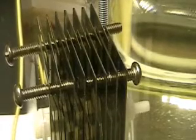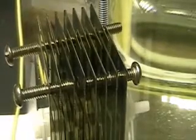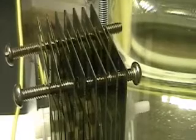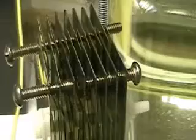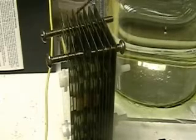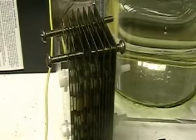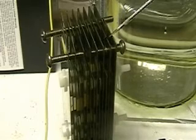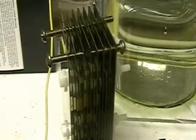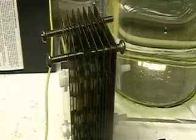This is hydrogen tap. What we're going to do here is a new type of test on the Aran cell — three inches by six inch cells. This is the twin that you're looking at, and what I'm going to do now is tie these three together and these three separately, having one plate that's standing alone. The reason I'm doing this test is strictly to see what the different combinations will do for the hydrogen flow.